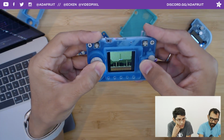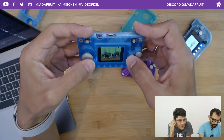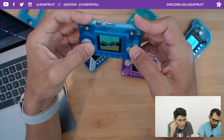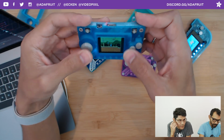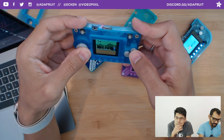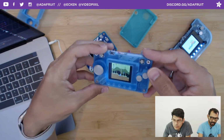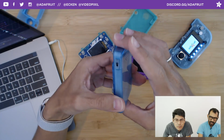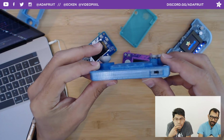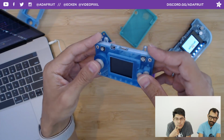That's one of the challenging things to do with 3D printing your own button actuators, getting them to not stick, because the Z and the layers, when they rub up against each other, tend to create some friction. So these are small enough so you don't have any extra geometry on there that you don't need, keeping everything nice and small, nice and slim. I had this carrying around all over when we were on vacation, and I sometimes forgot it was in my pocket because of how small it was, and these don't raise up too much. So, a nice little pocketable handheld NES emulator.